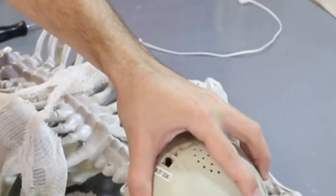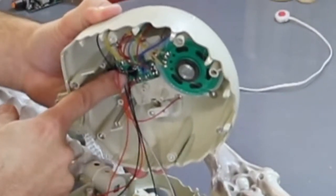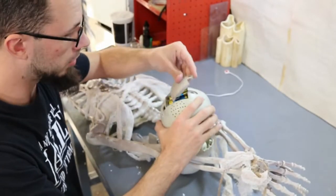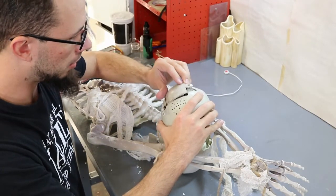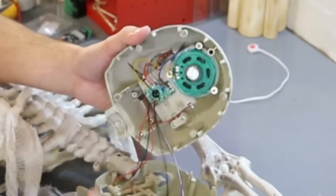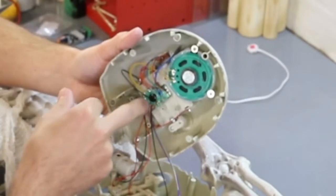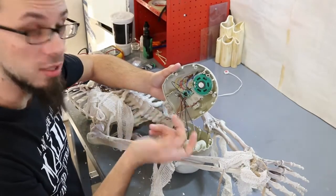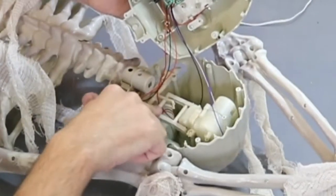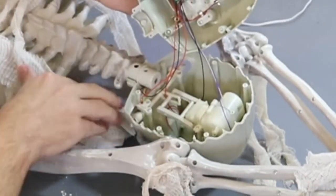So we're going to pull that apart. Now you can see in here — that's our little board. That's got the little program stored on it to make the mouth move and all that. It does also come with three AA batteries, for everyone who likes to collect batteries. Got a little speaker in there — it's nothing too impressive, but I save it just in case. I pretty much scrapped everything in the back half of the skull here except the speaker and the batteries. The little board, all the wires, I just cut them so this part can come completely out. Right in here is our motor. All it's going to do is move this guy here, which has a retention spring on it, which actuates this little armature that goes to the lower jaw.